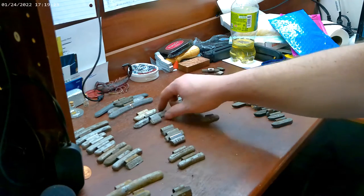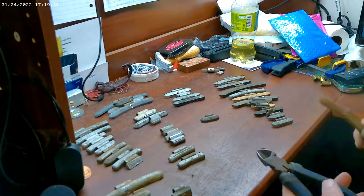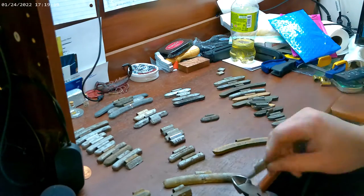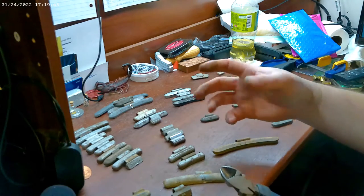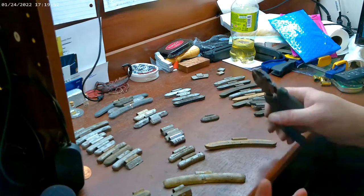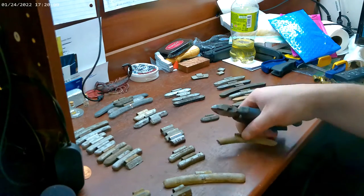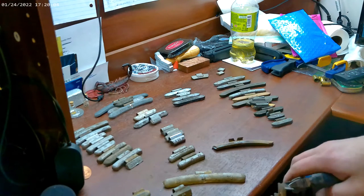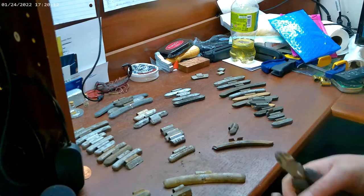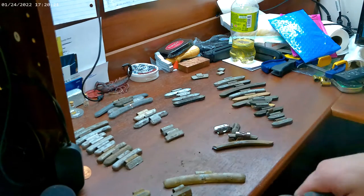So there's actually a hit test — if you get a nice-sized piece of metal and whack them on there, you'll learn there are three different sounds and you can sort them that way. But absolutely the best test is going to be the cut test because lead is the softest. Just like that — that's lead, no question about it. You don't have to cut them in half, you just want to grab them and squeeze. That's lead — it doesn't take much pressure to cut lead. We've got all these with different numbers and stuff on them — they're lead.